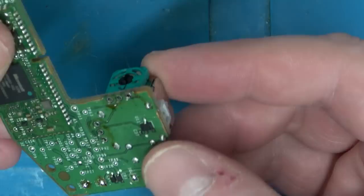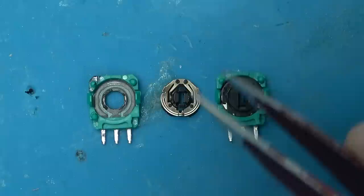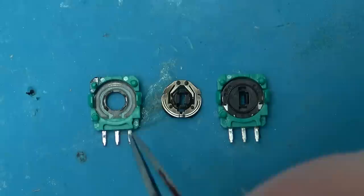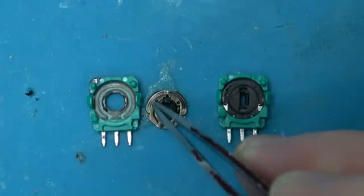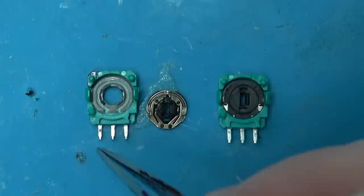So this is the offending pot — I'll put a V for vertical vendetta and mark the direction of bias. This is a carbon film potentiometer, using the conductive yet resistive value of carbon to create a variable voltage. The wiper goes back and forth; there's a carbon ring around the periphery, one end here and one end there. If you measure across, it's 9.7K. That side of the ring looks deformed — compare that side to this one.